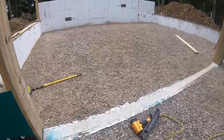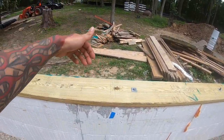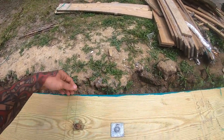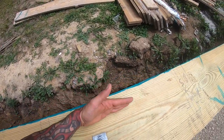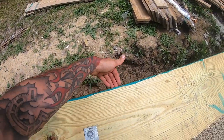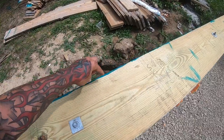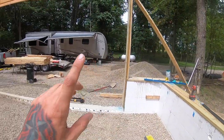Now to be able to put those OSB panels down and secure them - because now I don't have a sill plate to nail to - I'm probably just going to take a two-by-four and run it between the stud locations, screw it down to the sill plate. Now the backside of the OSB panel has something to screw into instead of just having that panel where it can move. These are two feet on center so that panel could want to flex in the wind. I'll cut some two-by-fours, throw them down in there - you'll never see them because all the insulation will be in here and the drywall will come up. But that'll give something to screw that OSB panel down into.